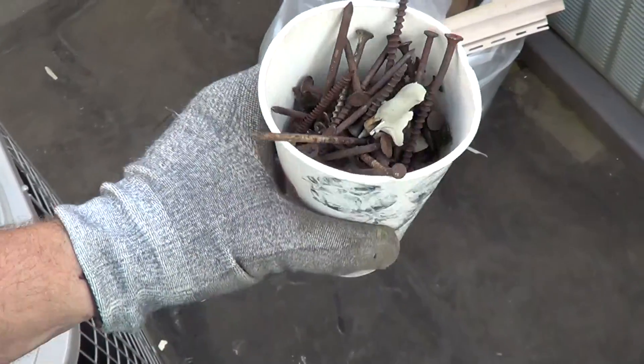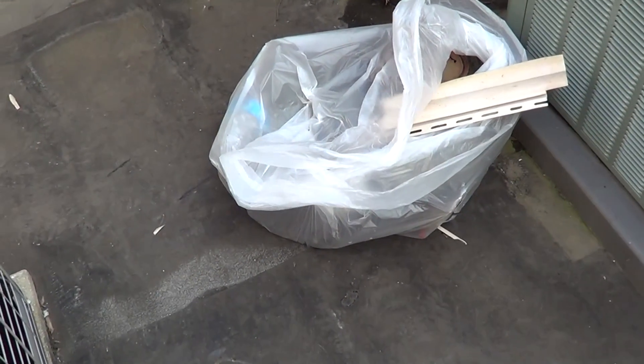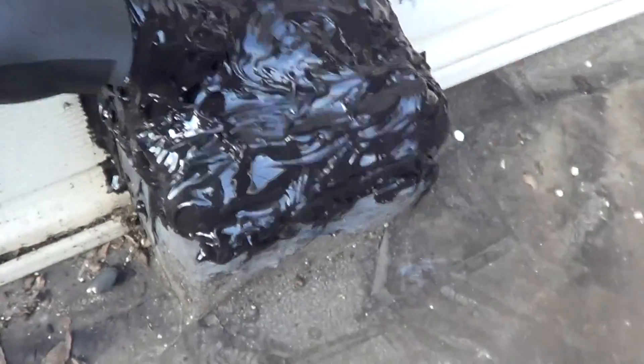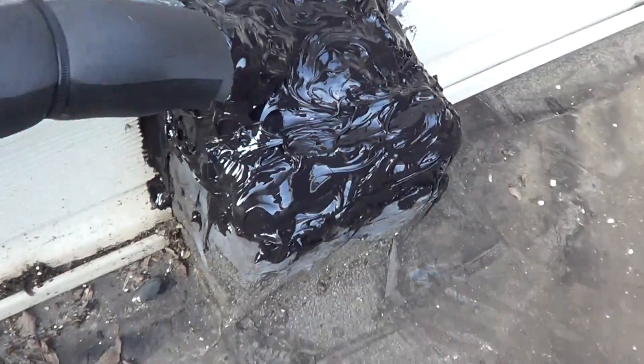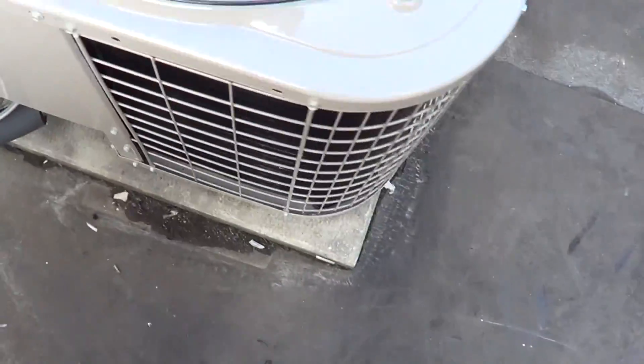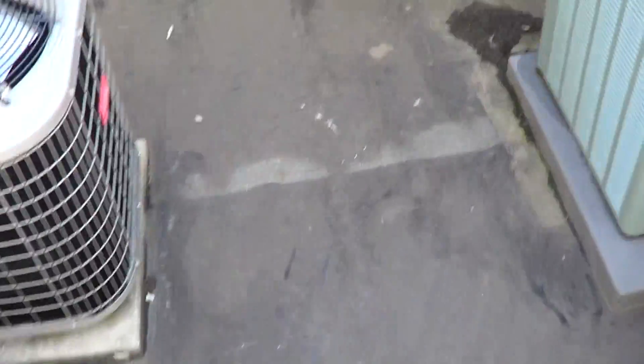I cleaned up and got all the screws off the roof and a big old bag of trash — quite a bit collecting. We got the installation completed. We've got our new insulation and I used sunlight-resistant silicone. Fixed up the water leaks on the roof jack. Got the filter dryer installed. We've got new outdoor-rated wire for the power. Turned out a nice-looking job — and of course cleaned up the roof.